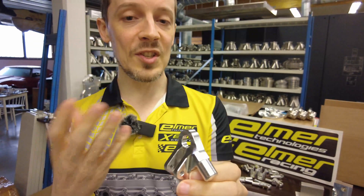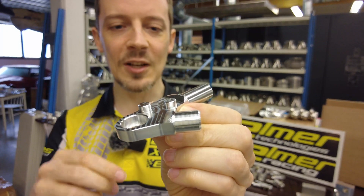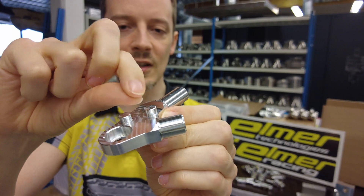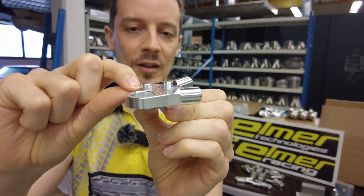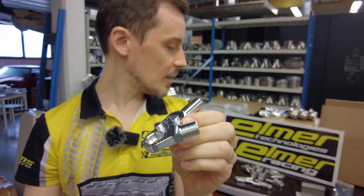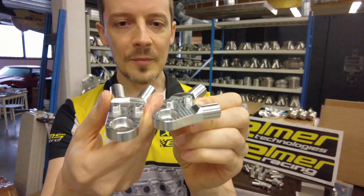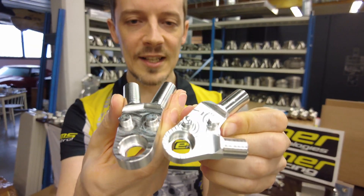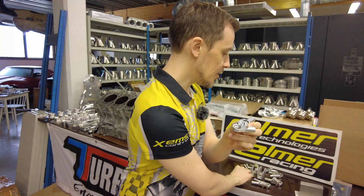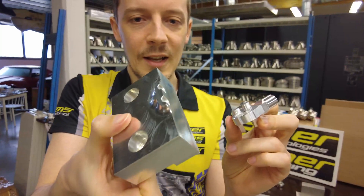The solution we came up with — that we suggested for the team and that they accepted — was to do standardized mounting locations. Just two extruded cylinders here with a very short distance and an optimized distance between these two mounting points. As you can see, we have the exact same mounting on all of these. They can be at different angles, and these are to allow us to make mounting jaws.